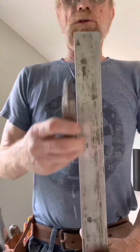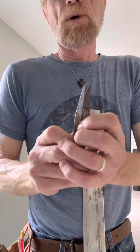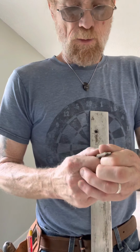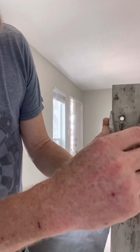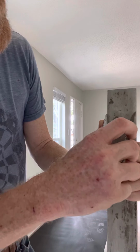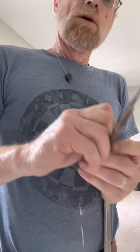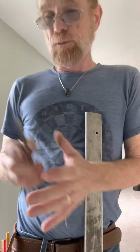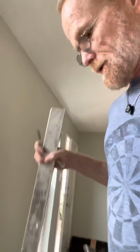And what we'll do is we'll use this as a gauge, because we need to get in spots where we're needed. We'll be able to put this in underneath the dishwasher, underneath some cabinets. And so what you do is you line that up perfectly with your gauge. And there you go. You want to lock that down. You periodically want to check this because this does slip. You can also take on your paper here, and just in case you get lost, what you can do is you can put your gauge down on the floor.